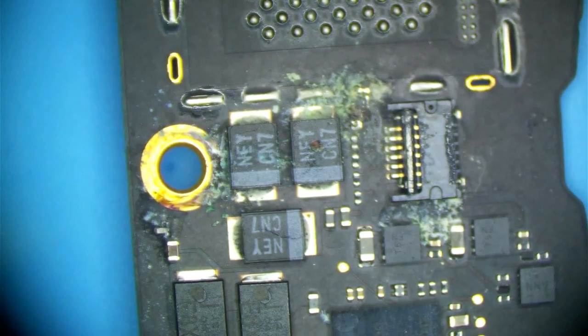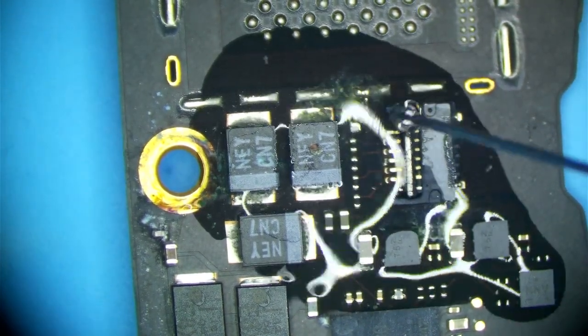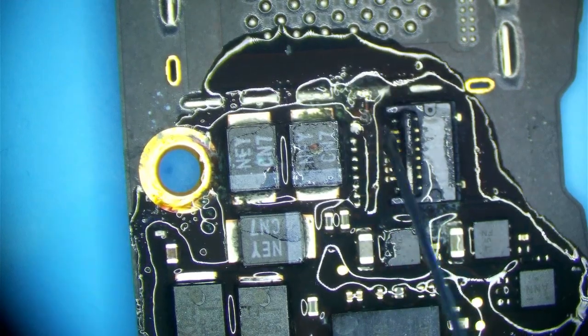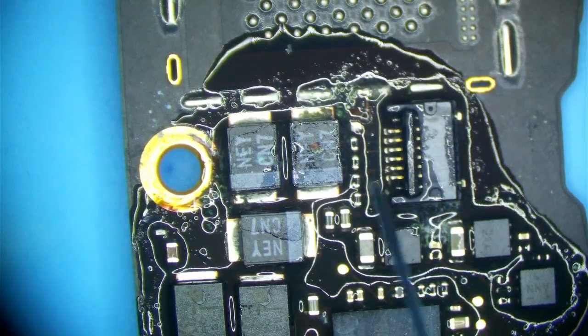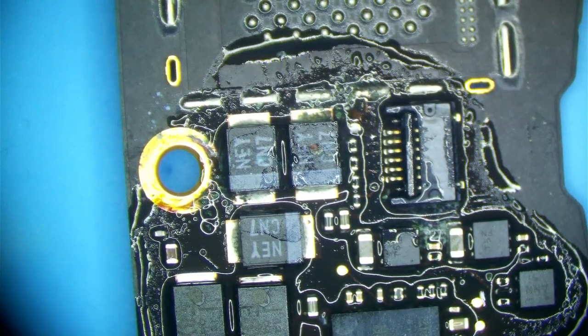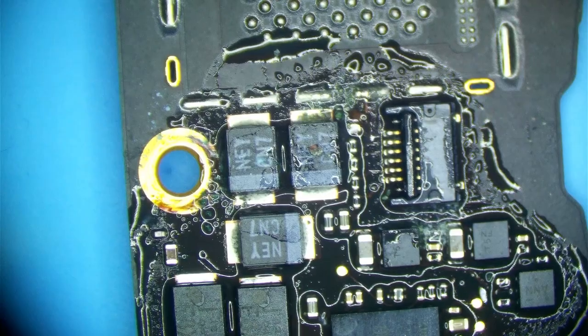And we're still getting that same 2 amps here, so that means that something right around here is internally shorted. So I'm going to have to get my X-Acto knife and make a little hole right here. It's probably going to be this via. So if I can make a little cut here to this via and get all this out of here, the board should be okay. That's just for microphone. We're probably not going to get microphone back, but the data should be recoverable, and that's at the end goal what we want. And actually now our amperage went down quite a bit. It's still not normal, but it went down quite a bit there.